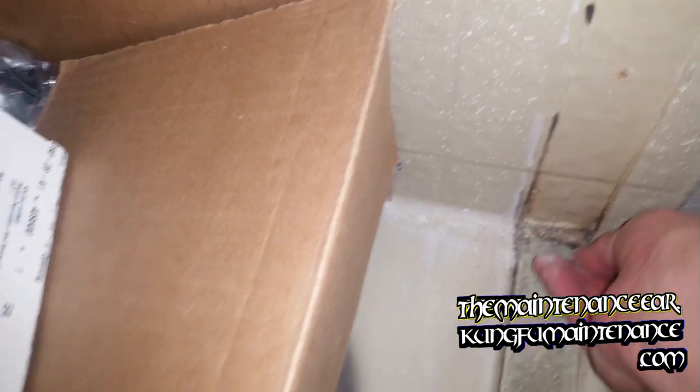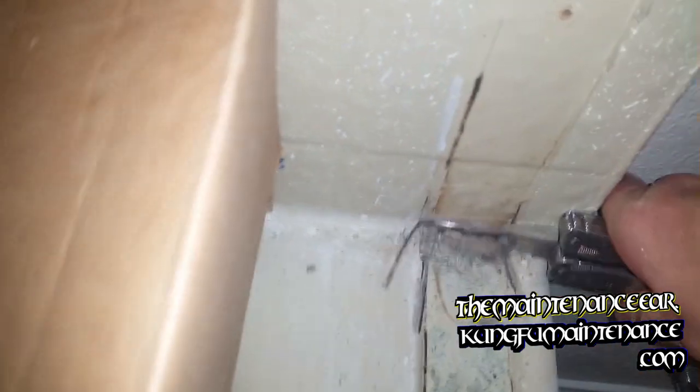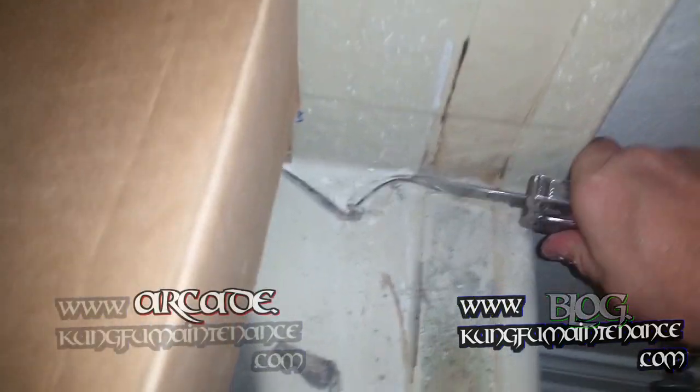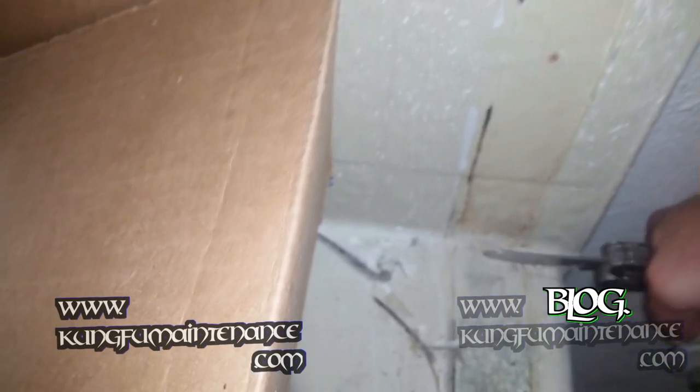You know, come back and caulk and touch up paint with the appliance touch-up paint, the little holes, seal those off, seal the moisture out. Again, I'll show you this corner area. You just take the razor, get down close to it. Can't really get all the way in there, and then take my flat blade knife and just get all that stuff out of there. And that's how I get the corners quickly and easily. And the rest I do with the razor.